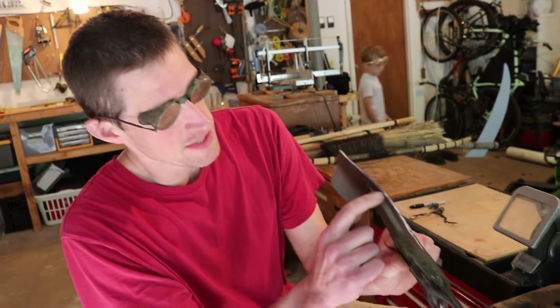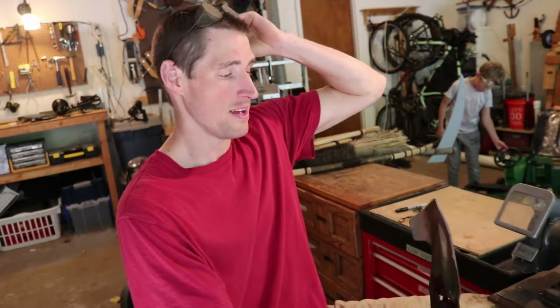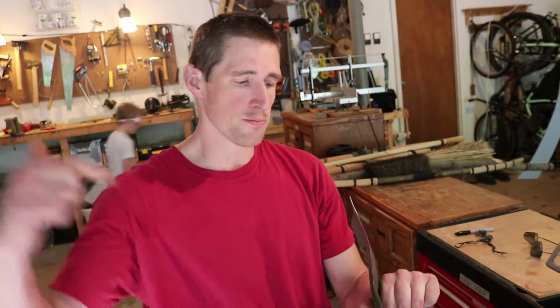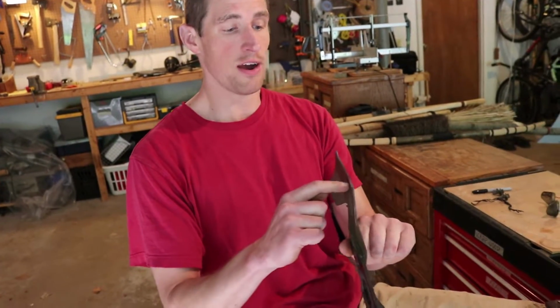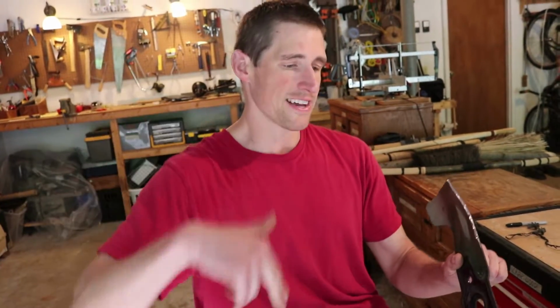Now you see these serrations here from the chips and everything. Again, I know nothing about lawnmowers and lawnmower blades, but just from my knowledge about blades in general, I think this serration is a good thing, because it increases the surface area of the edge. It gives more cutting area to the edge. If the edge was entirely straight, you would have, let's say, 10 centimeters of edge. But because of those serrations, you have 12 centimeters. More surface area to cut the grass.